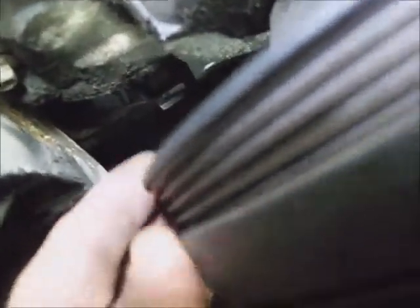I had that little punch against this inside hub part, not against the outer pulley on the inside of that rubber. Just keep it off there — you could even chip this and it'll eat the seal out.